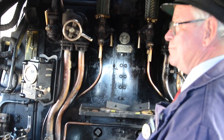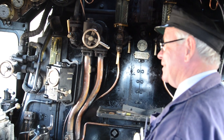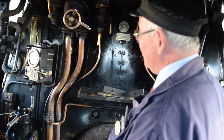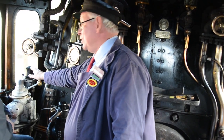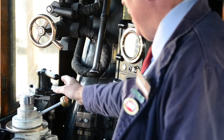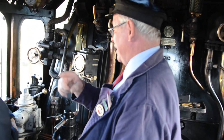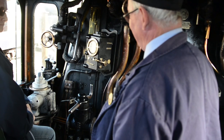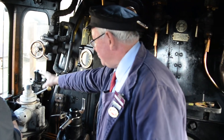So we know how we're going to go forward, we know we're going to get faster and faster. What we need to know now is how to stop the locomotive, and that's the art — because you know where you want to stop, you've got to start braking before. If we were light engine, which means we have no coaches behind us, we would use this brake. So to recap: direction change, accelerator, braking system.